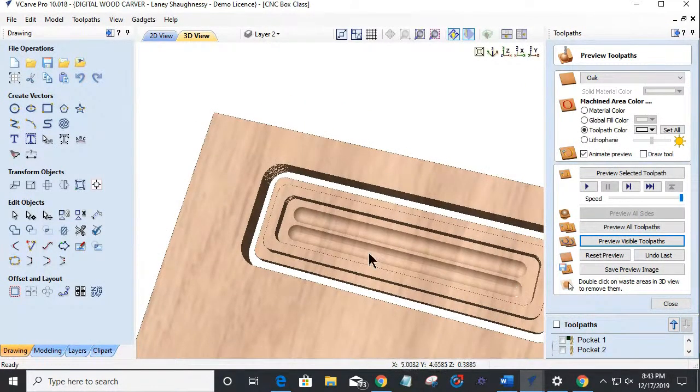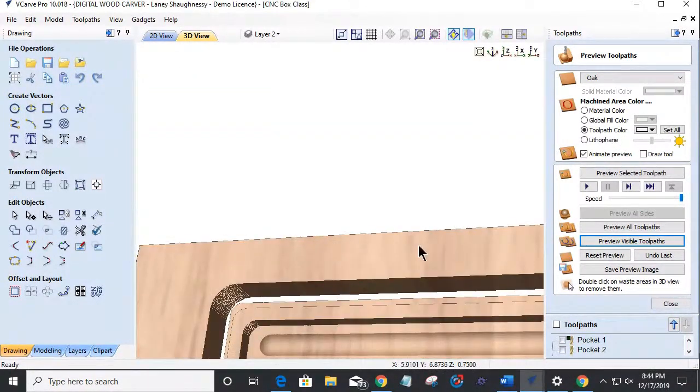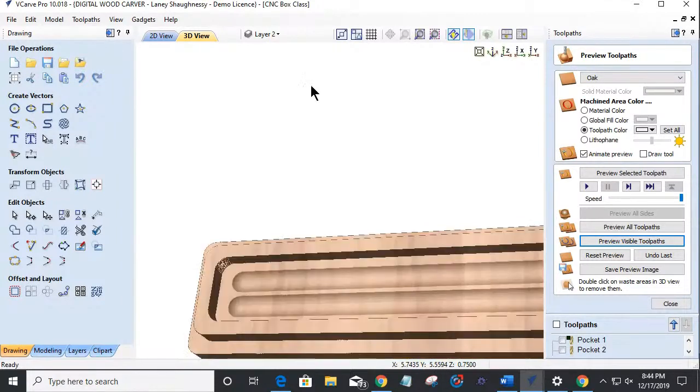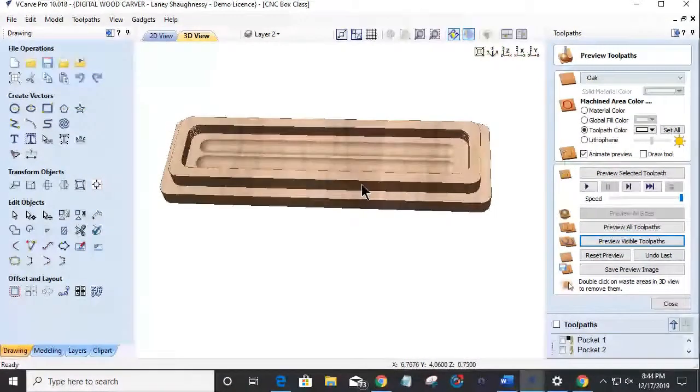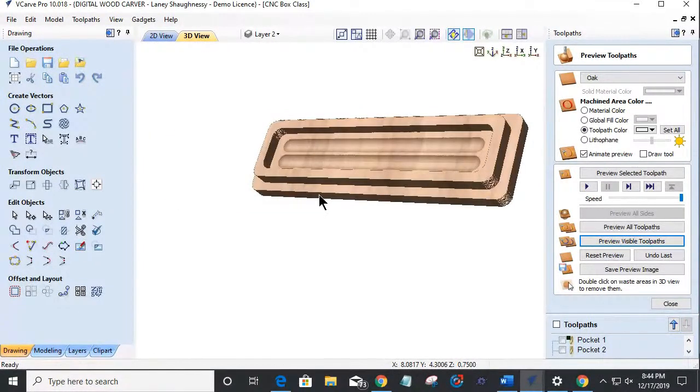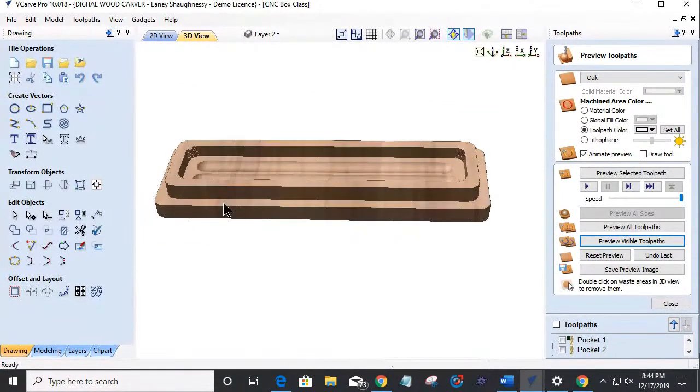Okay. So spread the lines a little bit wider apart, use my 3/8 inch bit. Now I've got two cavities that my pen and pencil could rest into, so they're not rolling around. I could still cover this with felt. I would flock it with glue and flocking instead of an adhesive felt, so that I don't get wrinkles in the felt when I'm trying to press it down in that. I would just flock it. That would be how I would do that, Robert. Let me know if that helps you out.